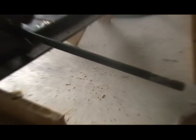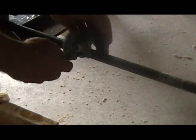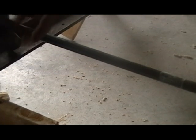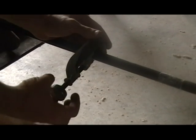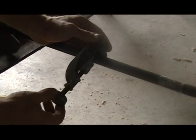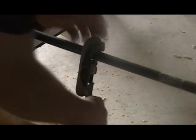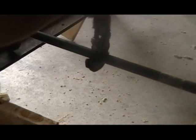We've marked the pipe where we need to cut it. We're going to use a pipe cutter. If you haven't used one before, you put the wheels on the top, which help keep your pipe in position. Press them on the pipe and then screw this thing until it comes in contact. Don't put a whole lot of pressure on it, but put some. And every so often, when it gets a little bit easier, keep spinning.